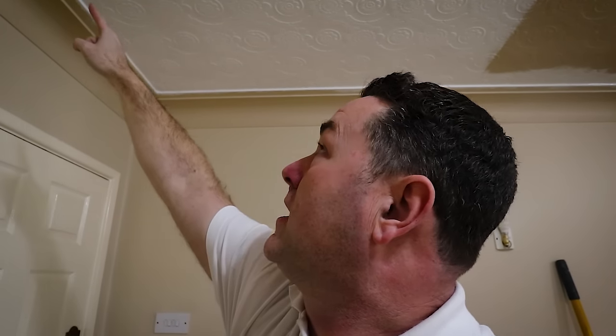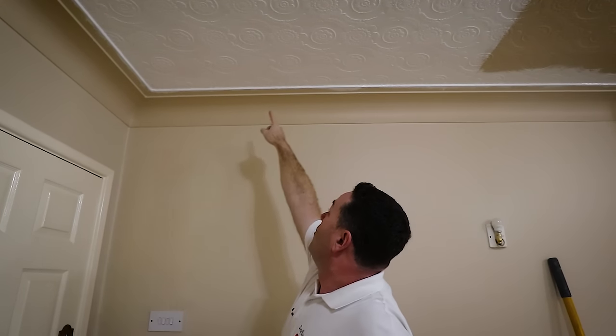I'm going to say wow! I know some of you are going to moan at me saying you should be using the 12-inch roller, but the beauty of using the 9-inch is you've got a little bit more control, it's not too big. Also, when you've not got a double arm roller and you've got a single frame roller, you can actually get in quite close to where you've cut in with the brush - there's no need for a mini roller. You can get quite close into that edge all the way around.